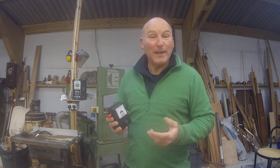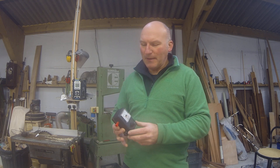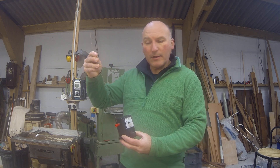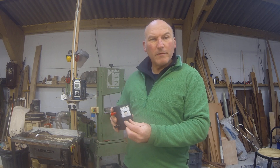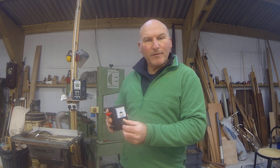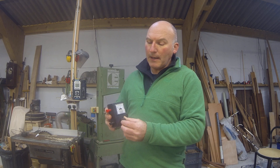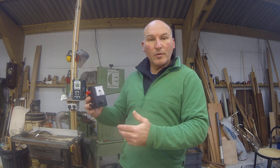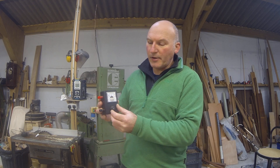Having something like this is a little bit of test equipment that can be ideal, and you probably don't think you need one until you've got one. So what is it? It's got an antenna - I've just got a short random bit of copper wire here. It has a meter and a variable resistor. The variable resistor acts as a sensitivity device.